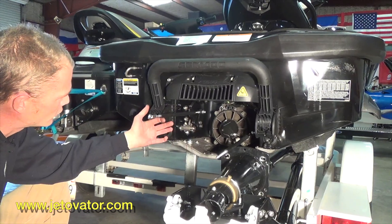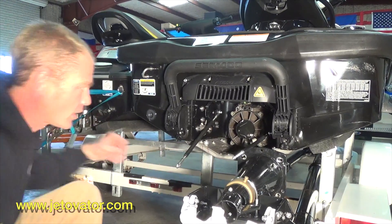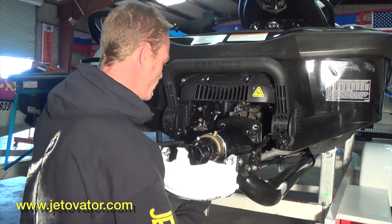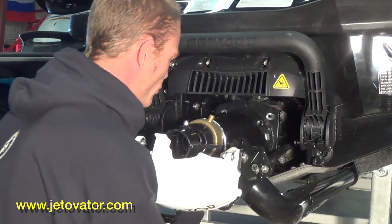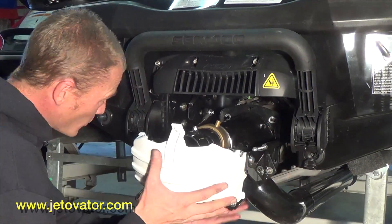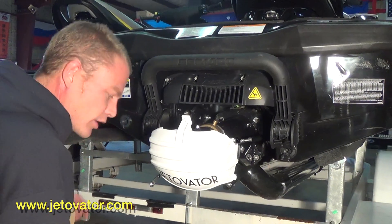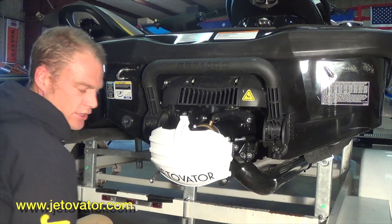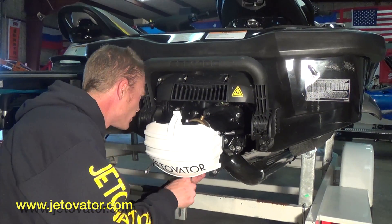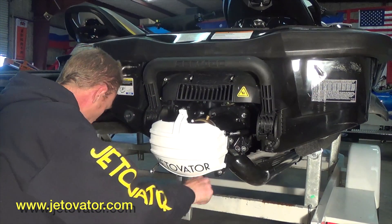Once you get your steering linkage hooked up to the bracket and everything is tight, that's pretty much it right there. What you're going to want to do is assemble your thrust adapter in. The reason I take the thrust adapter out is it just gives you a little more room to get in — a lot of times you'll be running into parts. What I like to do is snug up the two bottom bolts. I don't want to tighten them down a lot, but just snug them up. Make sure you get them all threaded and you're not going to cross-thread anything or strip anything out.